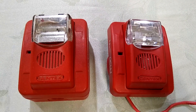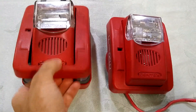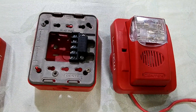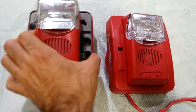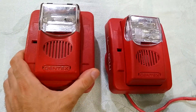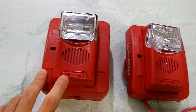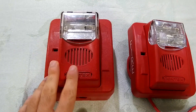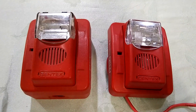I really love the design on these horn strobes and how easy they are to install. All you gotta do is pop off the cover, slide that horn strobe out of there. To take it apart and put it back together, just slide it back in and pop on the cover. Now if you want to make these extra secure, there is a mounting option where you pop this Gentex logo off and there's a pin that goes down there to prevent you from sliding it unless the pin is removed. But I'd imagine most installations don't use that feature.